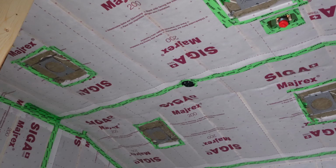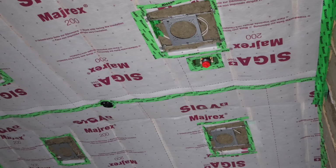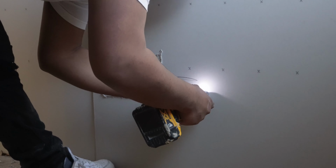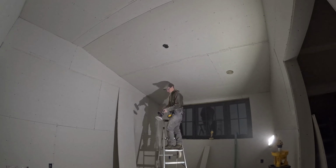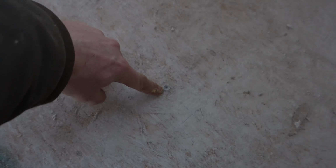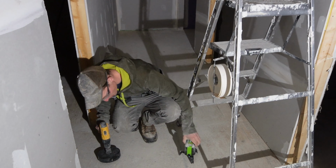However, once I hung up one room worth of the mounting frames, I realized it was actually more of a pain to get them centered perfectly, hope they don't move, and trust the drywallers not to forget any of them than it was just to come back myself later and drill them out. I used a drywall screw on the floor to mark each light location to make sure that it wouldn't get wiped away in the sea of white dust, and it took no time at all to drill them out with my laser and a hole saw after drywall was hung.